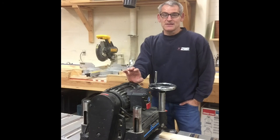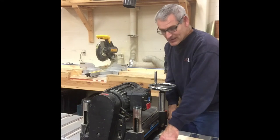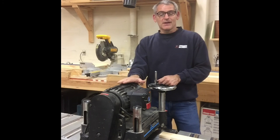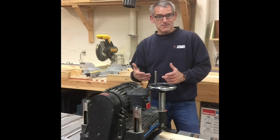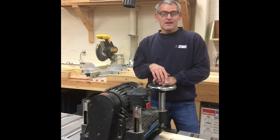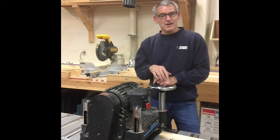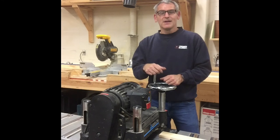Other factors that play into this: the type of material, the harder the lumber, the less you want to take off. The wider the board — this is about a 14-inch planer — the more surface area you're having to plane, so you want to take off a little bit less. How fast you're feeding it through also has something to do with how much you want to take off. The width of the board, the hardness, and the speed at which you put it through all factor in.